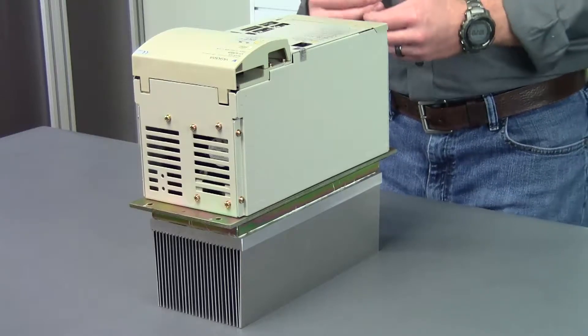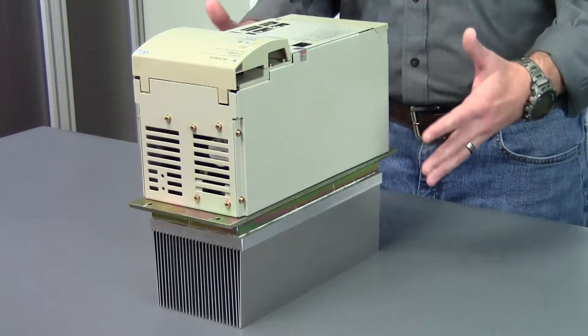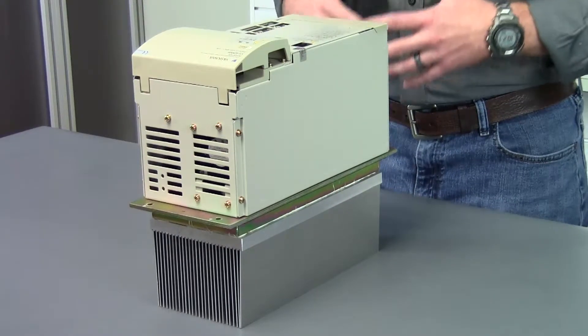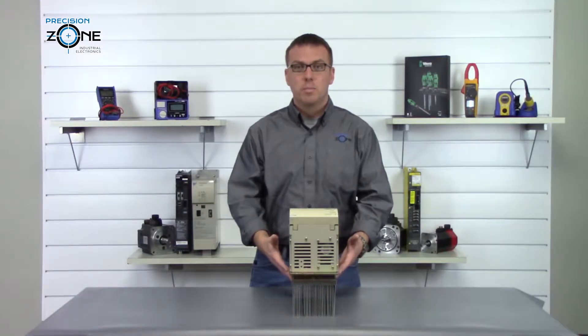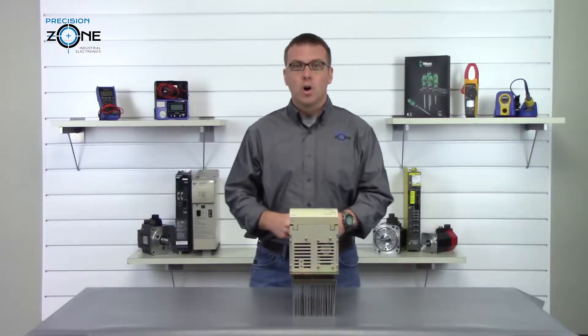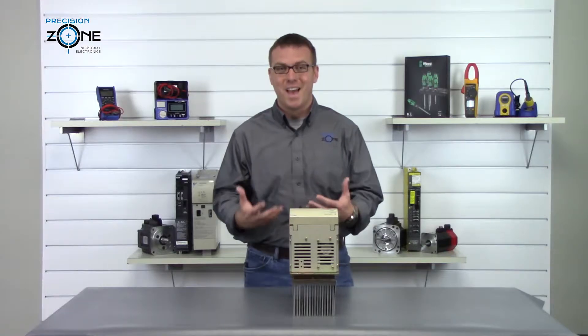Alarms in the 40s are temperature and overheat alarms. Check the cooling fans on the converter, on the inverter, and on the cabinet to make sure they're working properly. Always check all the heat sink fins to make sure they are free of debris. You'll also want to check the motor cooling fans to make sure they are operating, if equipped.